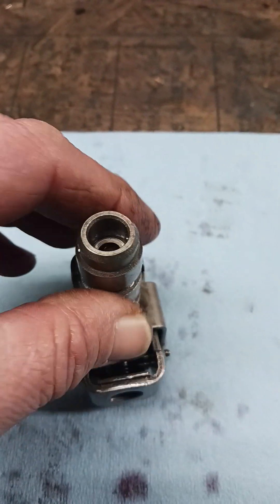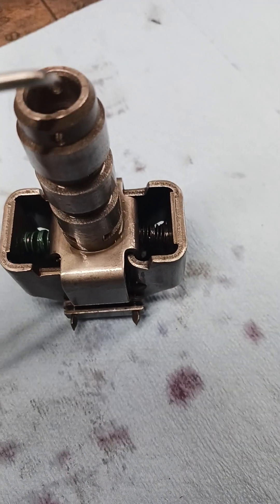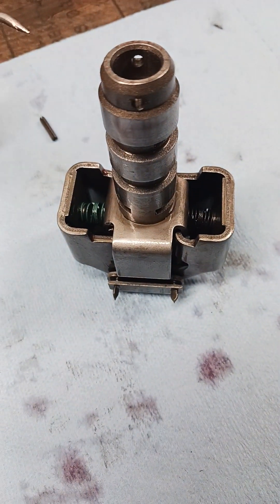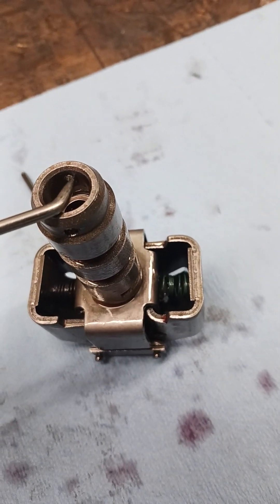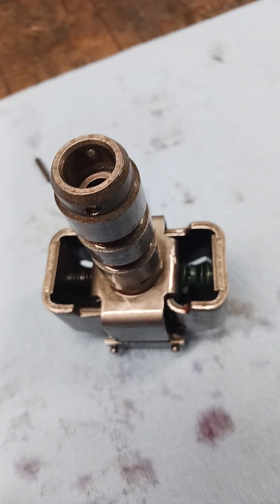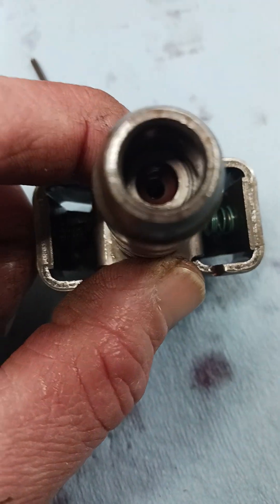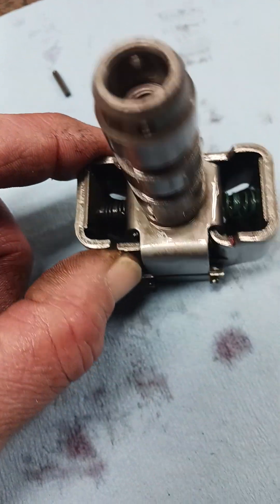Sometimes the roll pin that you knocked out — you can see right in here, there's a hole on the inside — the roll pin goes through the governor housing, through the gear, and through the hole in the gear. Sometimes the valve will get stuck and those holes need to be cleaned up with some emery cloth or thin sandpaper to smooth them out, so the valve doesn't get caught when you're removing or installing it. If you try to force it, you're going to scratch the journals on its way out.